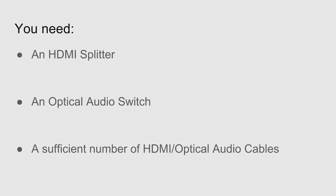You're going to need the HDMI splitter because the GameCapture HD has an HDMI in and an HDMI out, and anything that comes from that HDMI out is going to be stereo sound. There's no possible way to get surround sound doing it that way. So what you need to do is have one line going to your TV or home theater system, and another line going into your GameCapture HD — a separate channel for surround sound and a separate channel for stereo sound.